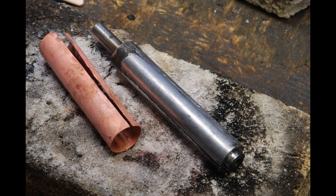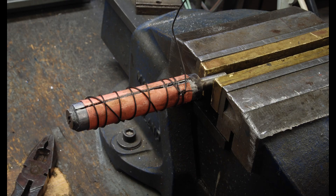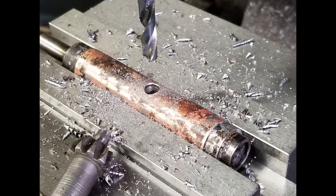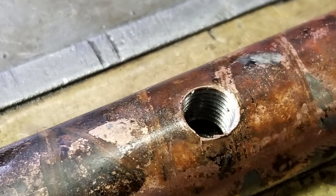Here's a nice piece of copper cut to size, annealed, and bent into shape ready for soldering. To anneal copper you just need to get it red hot — you don't have to quench it, that just allows you to speed up the process. The copper is held in place with binding wire and I soft solder it on using a propane torch for heat. Once soldered, I drill and tap halfway through for the adjusting screw using a fine thread for maximum adjustment. A small collar has been added and soldered in place at the far right end of the lap so that torque on the adjustment screw doesn't splay the whole lap open in a Y-shape. A set screw goes in and it's off to the lathe.